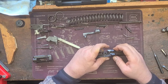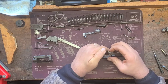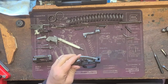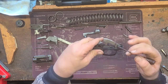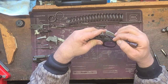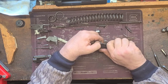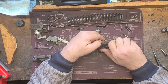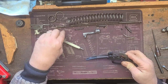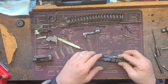Use the pressure of the hammer to hold down that spring. You've got a spring and a little detent here — make sure that stays captured so it doesn't fly across your shop. Use a screwdriver to press that detent down, and the safety sear just falls right out. Set it aside, pull your spring and detent out, and set them over here next to your safety sear.